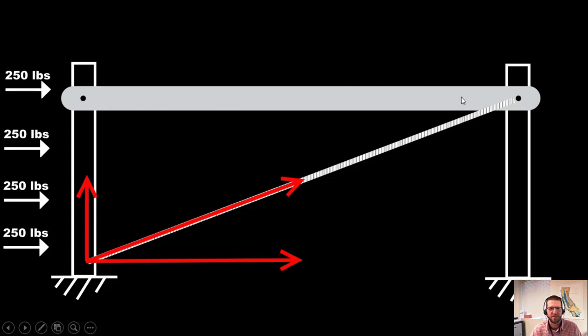If you extend the brace crossmember — say, 16 feet instead — the tensile force would lay further down toward the ground, and the vertical component would be much less. The NRCS spec says 8-foot to 10-foot crossmembers, but that's a suggestion. You can allow 16-foot braces in your projects if you want to.